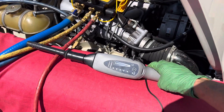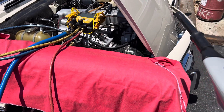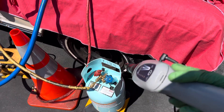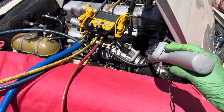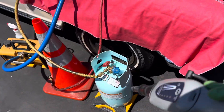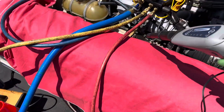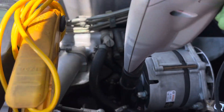We're going to use the whisper. As seen in the other two videos, under vacuum it was fairly well holding — wasn't picking up anything. At the high side where it connects to the compressor I could not pinpoint it. I put 235 psi of dry nitrogen in and the thing was just whistling and howling. Even with my fingertips down inside there, I could not pick up anything. So I added UV dye. I have nitrogen refrigerant going in as vapor — see that red line, that's vapor, not liquid — going into the suction line. We had a leak that was so big it was howling and whistling.